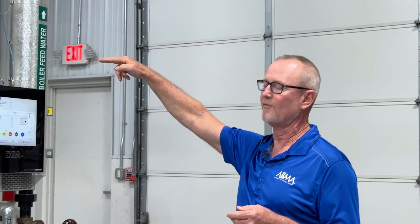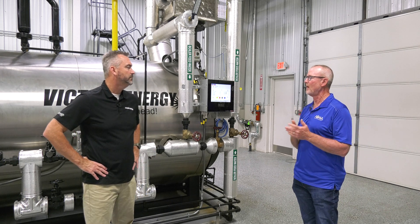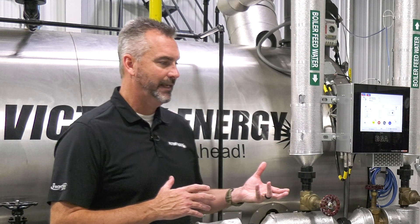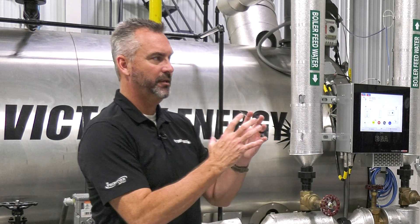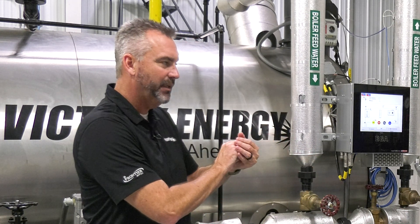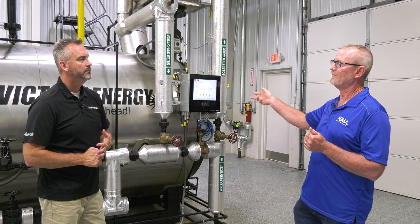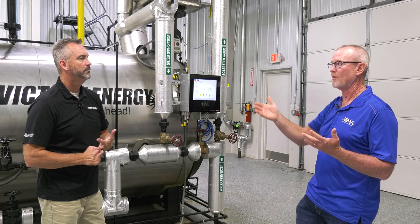What the burner is designed for is zero pressure at the stack — zero pressure at the stack. If it's positive or negative, either one, that's not good. We want zero there because there's a pressure drop through the boiler the burner is designed for, and it wants to see that pressure at the burner head the same all the time — we do that with pressure sensors and a servo on that damper. Whether it's water tube, fire tube, two pass, three pass, four pass — manufacturers are taking the burner and designing it for a specific boiler configuration. The burner is designed for the back pressure that the boiler manufacturer communicates to the burner manufacturer. If we don't maintain that back pressure with the stack and whatever dampers we put on there, that pressure changes and the burner is not going to like it.